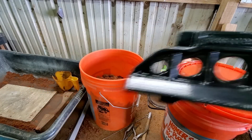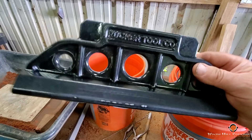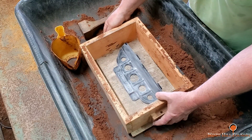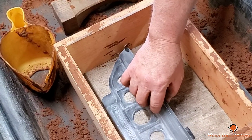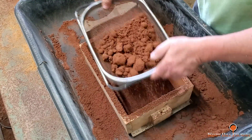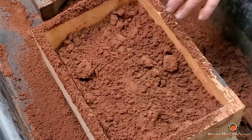This video is on how I make production patterns with aluminum using an original 3D printed pattern as the master, as is with this one Keith Rucker supplied. This pattern will be for the 12-inch straight edges, the Rucker straight edges that will be available soon. The flask I'm using is smaller than normal, but it was convenient for this application, and we're just pouring aluminum so I'm not worried about burning holes in the flask.